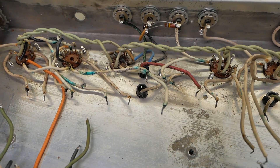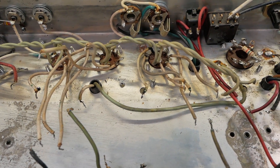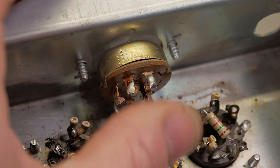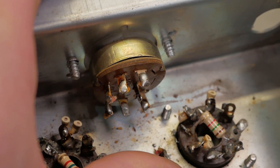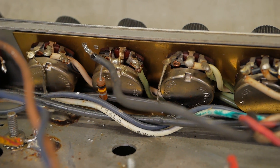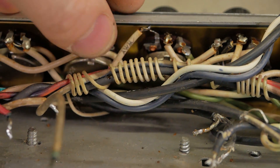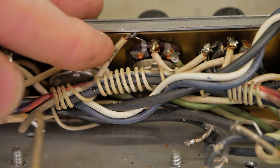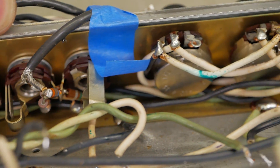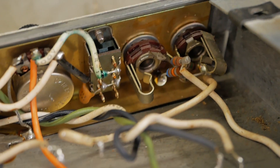Writing on the inside of someone's chassis just makes you look like an amateur - it's rude, like writing on the inside of a car bonnet. Also, I've disconnected the multi-tap primaries from that voltage selector switch, which is starting to warp - not an area we want to fail. We'll hardwire that in a particular safe way I'll show you when I do it. Looking at the pots on the front panel and the jacks - that all looks original. One appears to be touching the chassis, pushed over sideways - we'll fix that. There's the same green slime coming out of some wiring here too.